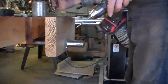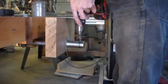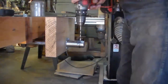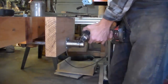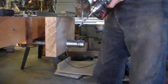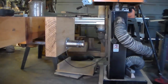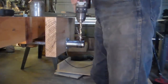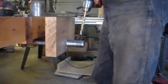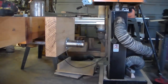I decided not to put a wooden handle on this one, and actually drilled through the 1 3/8" bar first with a 3/16 inch bit, and then with I believe this was a 1/4 inch bit, maybe a little over a quarter, but I just grabbed a bit out of my little bit box. And then grabbed a 3/8 bit and re-drilled it again. And then I had to hunt around and find the 1/2 inch bit. The one that's supposed to be in my set was not in the set, because I'm terrible about getting things back into that set.